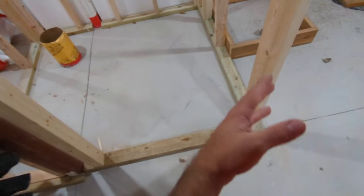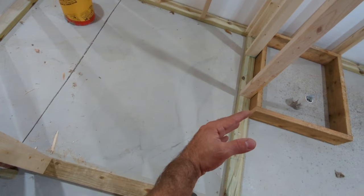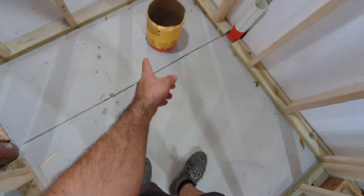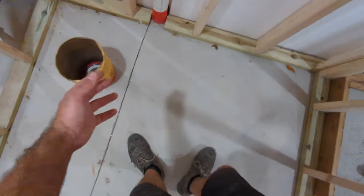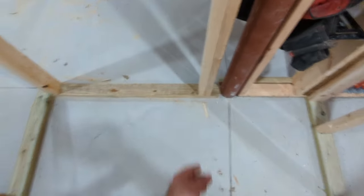Well, I arduously plotted out a 45-degree wall, and then we ended up with this other angle wall instead, and we built that all in. It had a plate on the top and everything, because the door swing was going to miss the outside corner of the vanity cabinet and the toilet. But the thing is, if this is the whole swing of the door when you come in, you can't get the door shut around yourself.